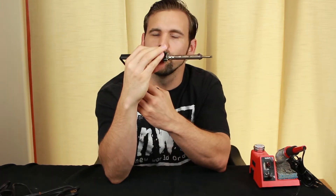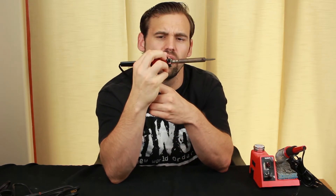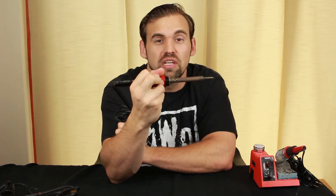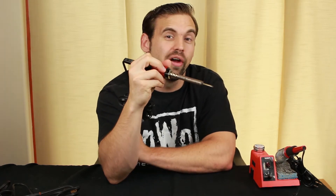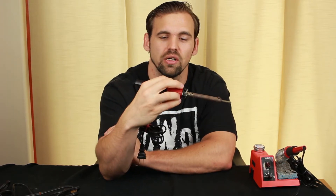Next we have a Sears Craftsman soldering iron, model 113 — a 45 watt soldering iron in pencil form. Eventually the Dunlap brand was changed to Craftsman. This was the soldering iron that I learned how to solder with. It's very lightweight and because it has a pencil grip, it allows you to manipulate the iron a lot easier. The biggest downside is that there is no temperature control whatsoever — you're getting the full 45 watts, which means you need to get in there, solder, and get out quick. It's not great for PCBs due to temperature sensitivity, but it's good if all you're doing is soldering wires.